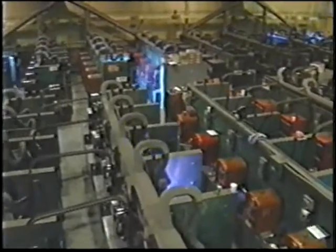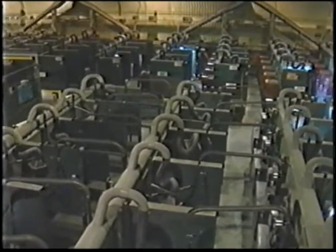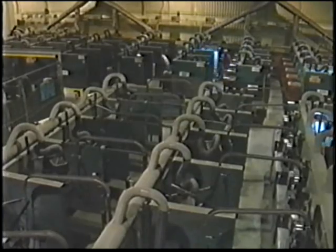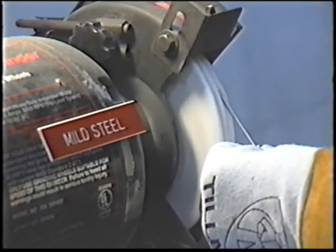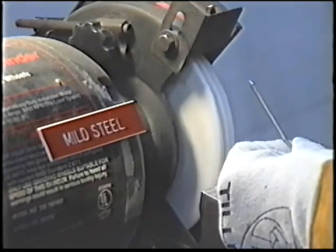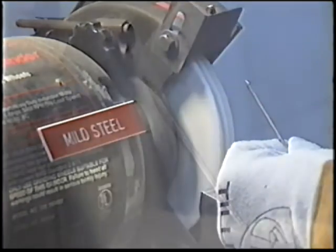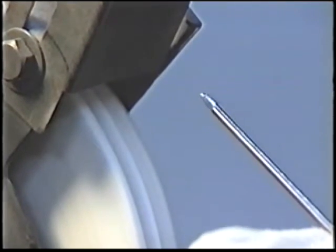In the world famous Lincoln Electric Weld Technology Workshop, TIG welding training starts with practice on mild steel. For welding mild steel, the tungsten electrode end must be ground to a pencil point. Make the point by grinding lengthwise, not across the end. A fine grit, hard abrasive wheel must be dedicated to this single use — the tungsten electrode tip will become contaminated if ground on a multi-use wheel.